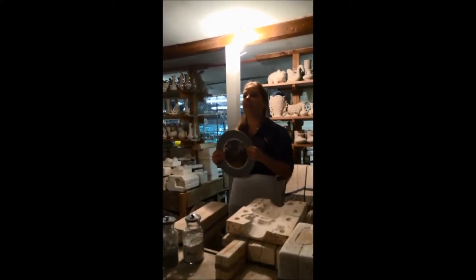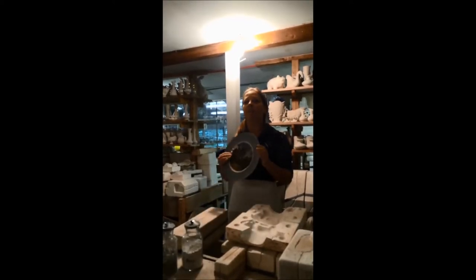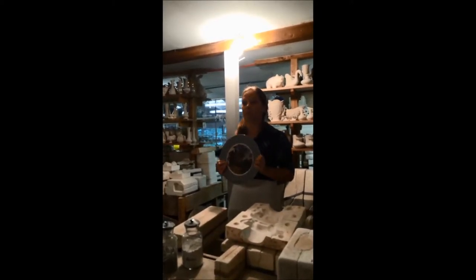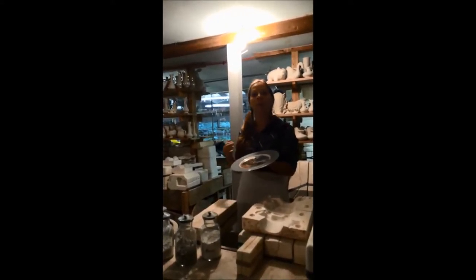Perhaps you use your china regularly, which is what we recommend. But perhaps you have it in the cabinet looking pretty for the last 10 years, or even in a box in the attic waiting to give to somebody. You pull it out one day, go to use it, eat off it, wash it, and go to put it back — and perhaps you've noticed fine hairline cracks have formed on that ware. That is called crazing and it is from lack of use. Your fine china's glaze gets brittle over time without being used; it'll start to dry out and then when you shock it with hot water and hot food, it cracks that glaze and makes those tiny hairline cracks. Once crazing has occurred, there's nothing that can be done for it — it's going to be there forever.